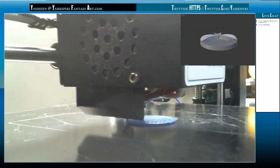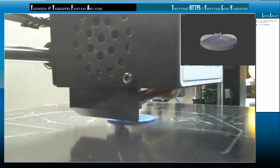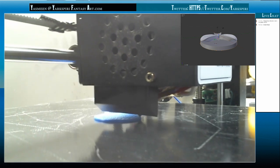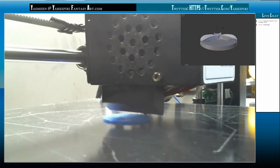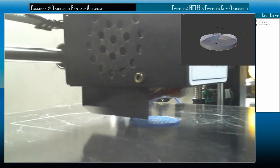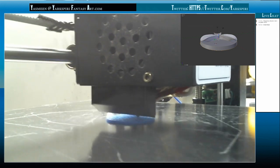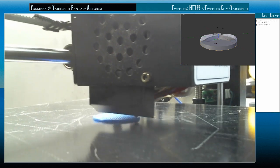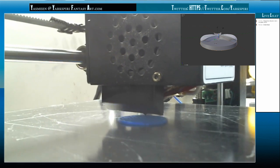That's so that I get a bit more resolution by doing so. With 3D printing, especially with FDM printing, most of your highest resolution is on the side because you can control the height of the printing. Now that will depend to a certain degree on the nozzle. I'm using a 0.4 nozzle, so you can do quite a bit.